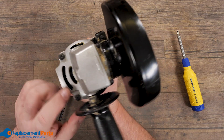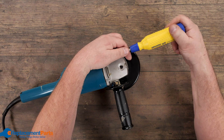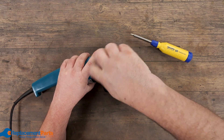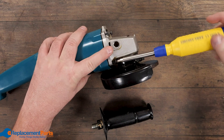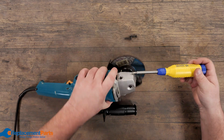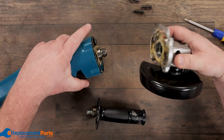You've got your four screws there, and then behind the handle there's your other one hidden back there. We'll go through and remove the screws — pretty well every grinder I've ever dealt with, the screws are always the same and there's only four of them. Just to make it a little easier for you to see, I'm going to unscrew the handle. Once I get the four started, I'll even out the pressure and just remove them completely. Once you get the four out, literally the head just pulls right out — you just wiggle a little bit and off it comes.